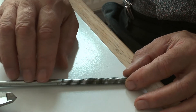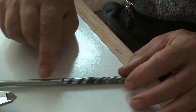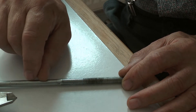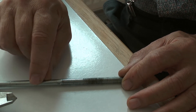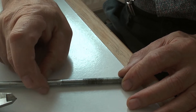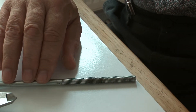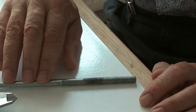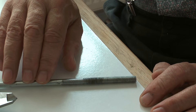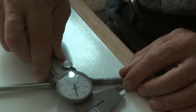The reason behind it is that when these part-threaded bolts are made, they roll the threads in under pressure, and that means this material here - the shaft - ends up with grooves pressed into it which form the trough or valley of the thread. The material that is displaced goes to form the crest of the thread, such that the crest will be wider than the shaft. You don't have any waste material like you would if you were cutting the thread, with swarf or metal swarf. I should have known this - it was a silly mistake on my part from making some false assumptions.